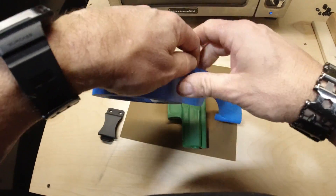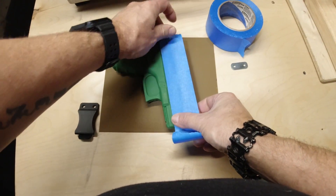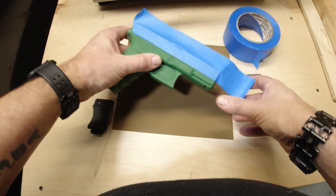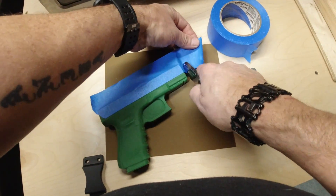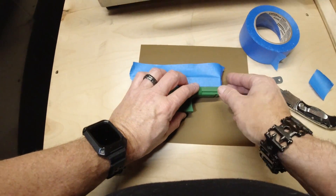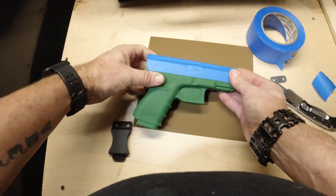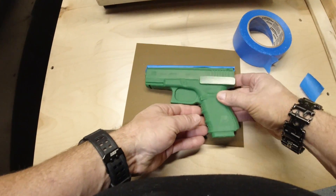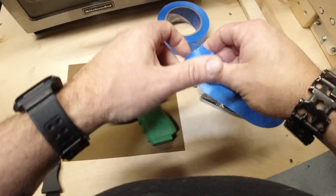What we're doing now is taping off the slide. When you tape the slide, do your best to make sure you don't have a lot of wrinkles — they can show up in the kydex when you form around it, so you want to try and get it as smooth as possible. There are a couple of reasons for doing the tape. One: the resin on molds, no matter what mold type you buy or what the brand name is, that resin does shrink over time slightly — it's just part of the curing process.